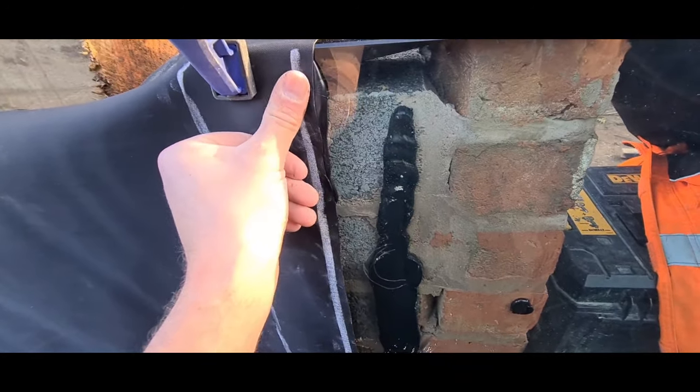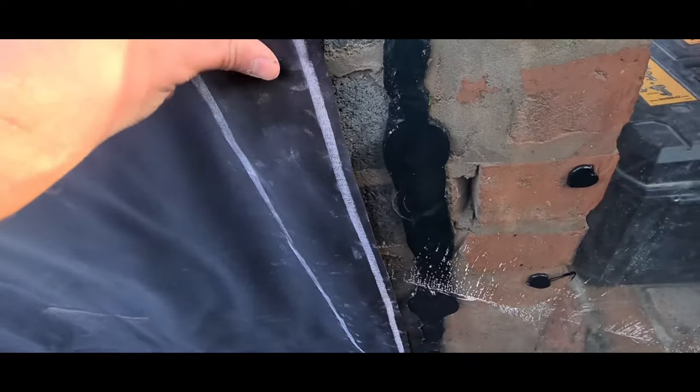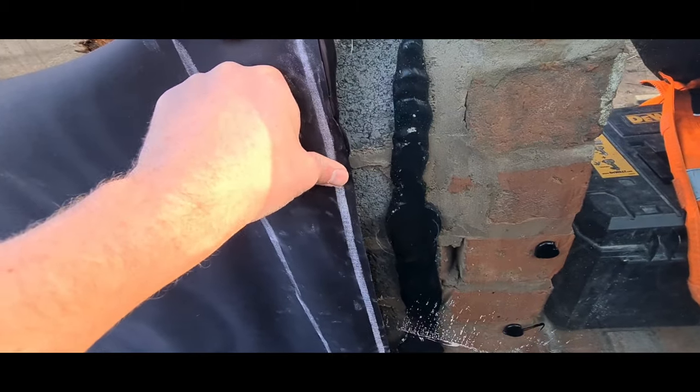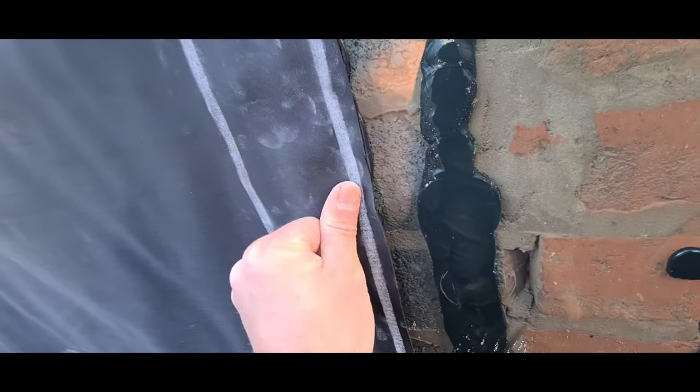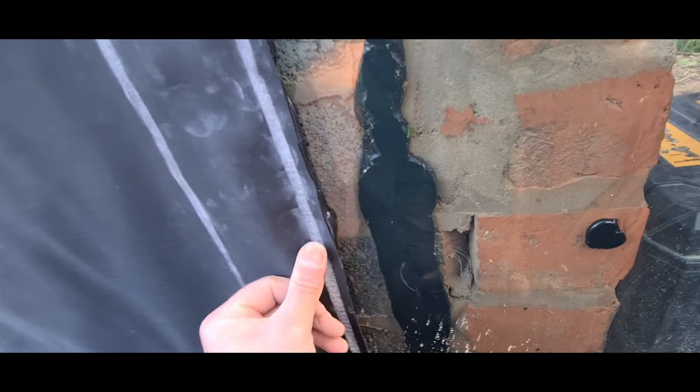The MS polymer sets best when it's got a few mil — you don't want to push it completely flat. And if you need to add more sealant, it's easy enough to do. You just keep pushing it so you see the sealant coming out, and then you know that's going to be watertight all the way around. Dead easy.